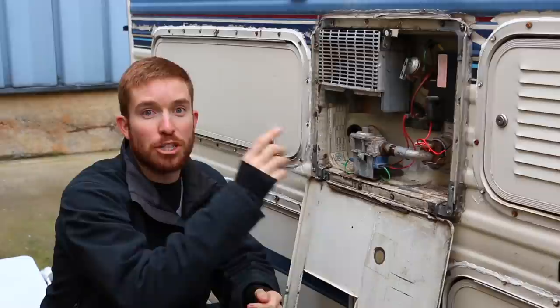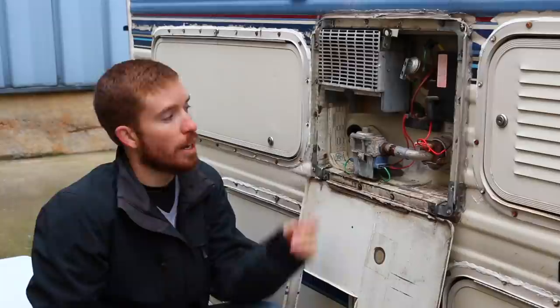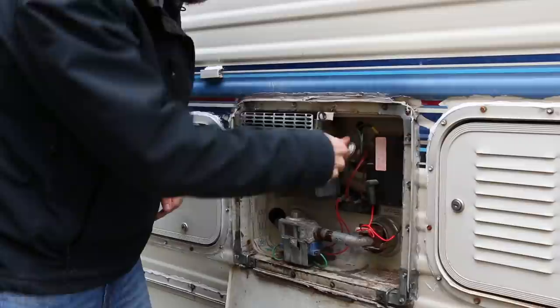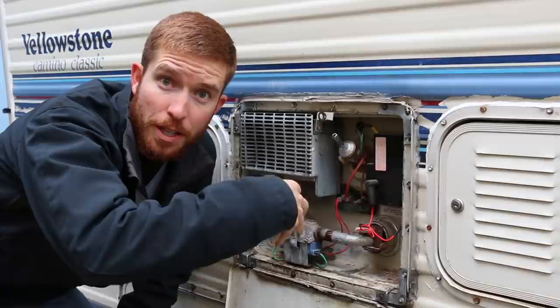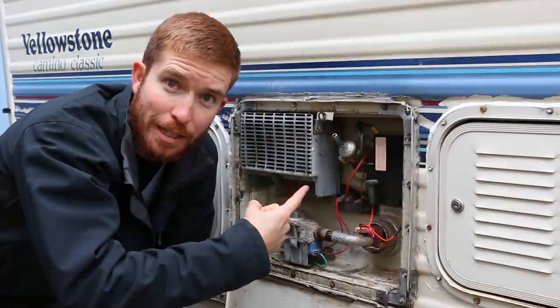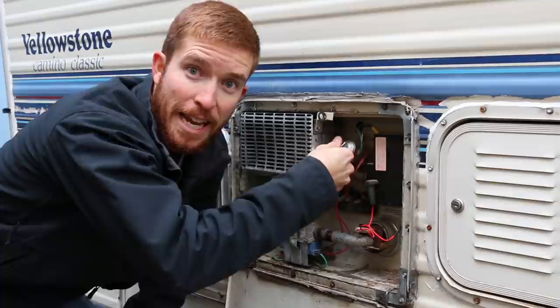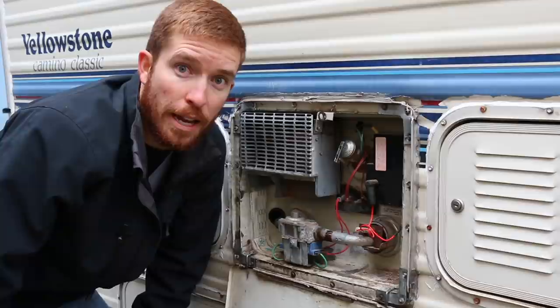What we're going to do now is remove all the water from this tank. There's a pressure relief valve right here and a drain valve right down here. I'm going to relieve all the pressure first by opening up the pressure relief valve. Normally water would spray out because there's usually pressure in the lines, but I've already relieved it a few times over the past couple days — just be prepared for water to shoot out and stand out of the way. Now I'll get a socket wrench and unplug this drain valve to let all the water out.